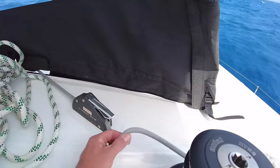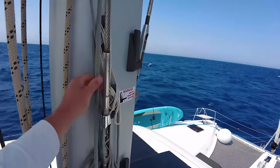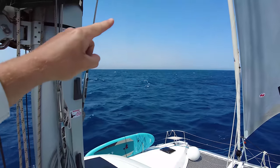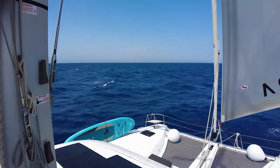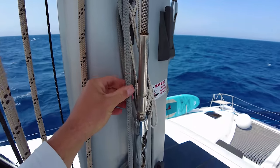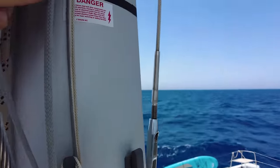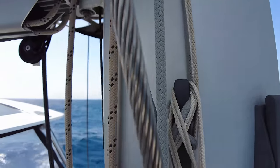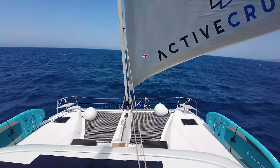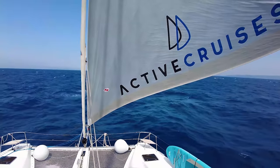Another important thing is the thickness of the halyard. Many boats put very thin ones, but you want a very thick one and you want it double. This halyard goes up, around the sail, and back up - it's attached to the mast, so it's actually a double line and a very thick one. Otherwise if it's a single line or double but much thinner, the halyard tends to stretch. The mast is 20 meters, so any movement and wherever the halyard enters the mast you can get friction and eventually failure. It's really important to have an oversized halyard and have it double.